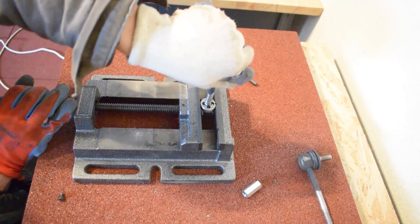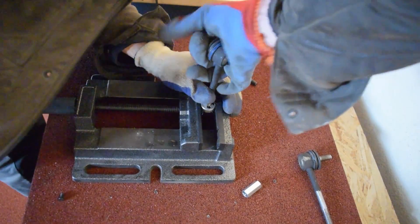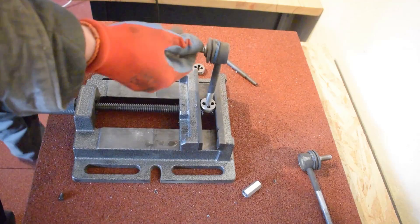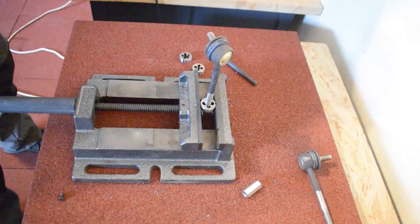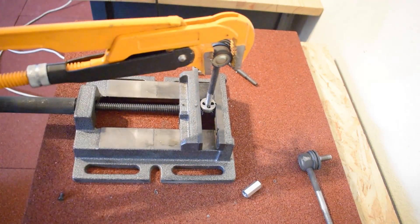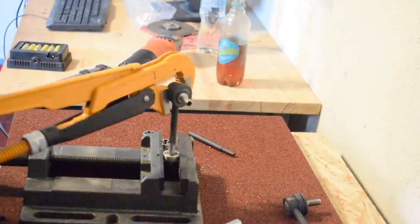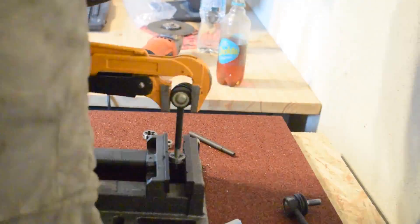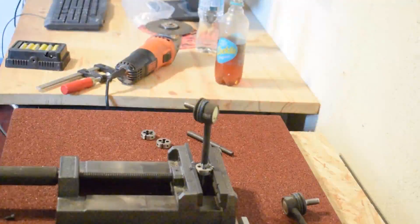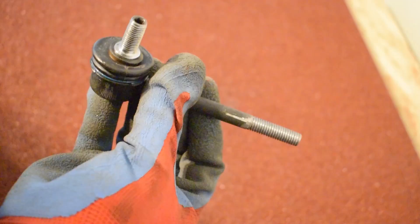The first part of the thread you'll do by hand, but the rest requires more leverage and power. Also, do not hold the link by the stud when making the thread, as you can damage it. I used giant pliers, grabbed the back of the stud, and twisted slowly until I made all the thread I needed. From time to time, back out a bit before going back in — this loosens the shavings from the threads and makes your threads better and cleaner.